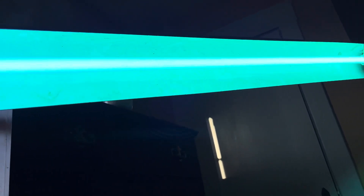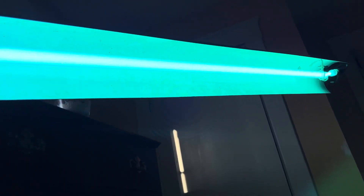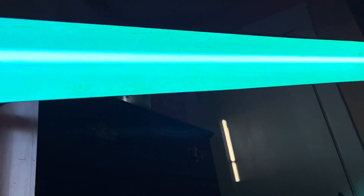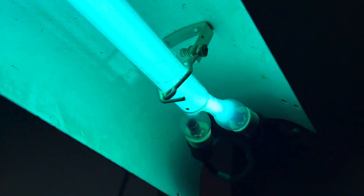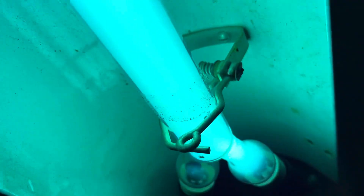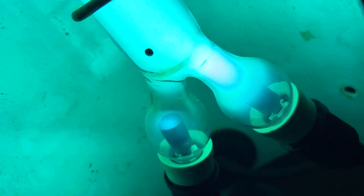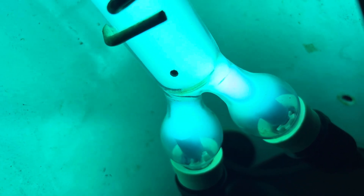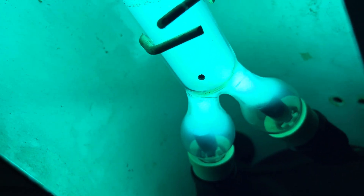It's equivalent to a mercury vapor 400-watt high-pressure bulb, maybe a little more blue since it's not as high pressure - it keeps the color spectrum closer to what low-pressure mercury would run at. Let's see the arc stream. Both ends are lit up, but due to the synchronization of the camera refresh rates it's only capturing one end. You can see as the rate shifts how the camera synchronizes with it, and then the other end goes. Very interesting.